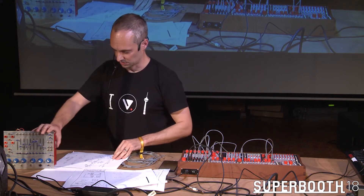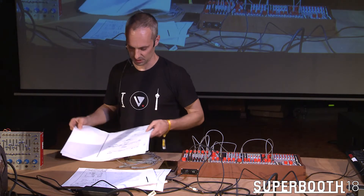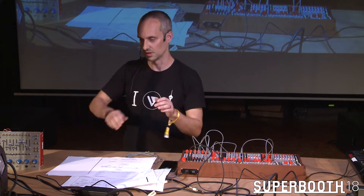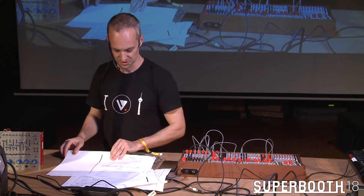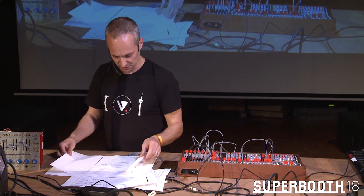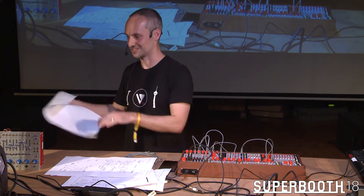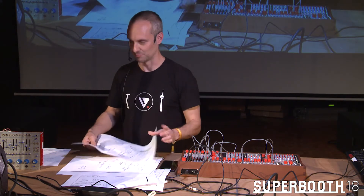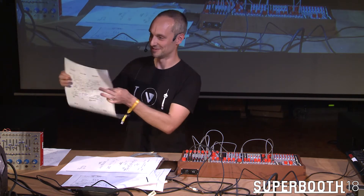Along the way as I started obsessing over this, I was going through what's called a sigma-delta or delta converter, where it turns the analog signal into a one-bit digital stream. What I found is that although the delta converter was first applied for a patent in 1963, the version that Don Buchla shamelessly stole was patented in 1976 — the same year he made the module.